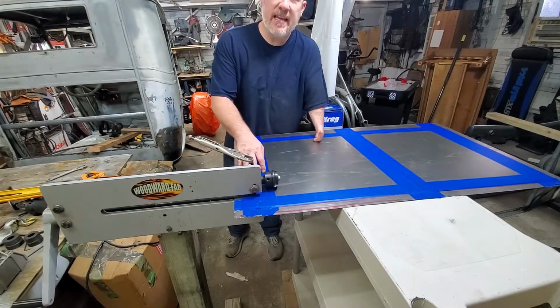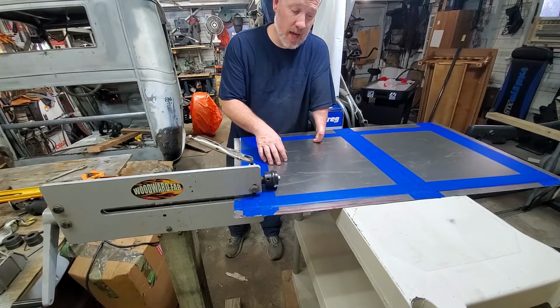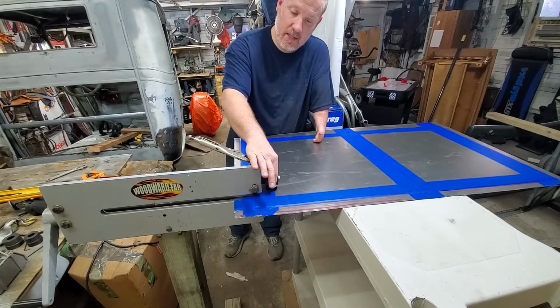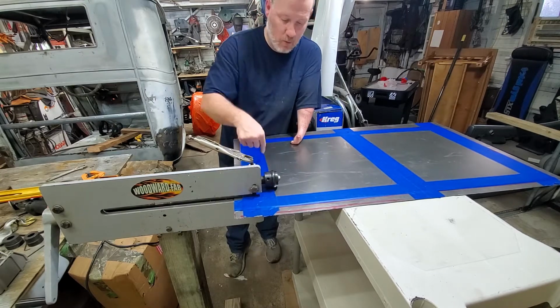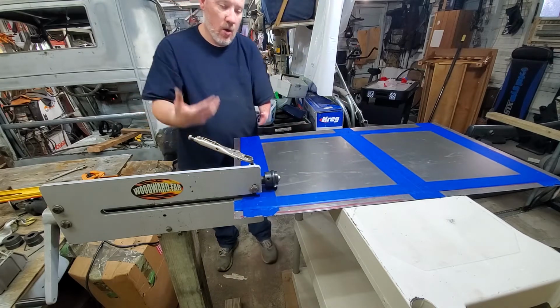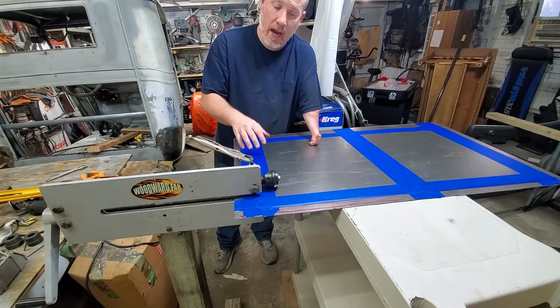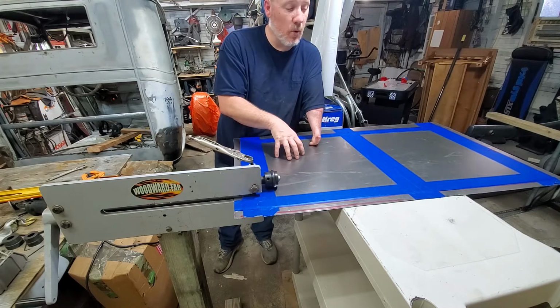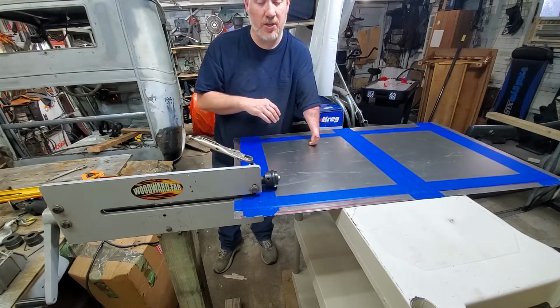One eternity later. So I relaid this out on the proper side this time, and I've switched out the dies to my thickest bead roll. It's just gonna put a round shape in it. It's not gonna be the exact same thing as what was done before, but I think it'll simulate it and it'll look good, and most importantly, it'll strengthen this and keep vibration out of it.